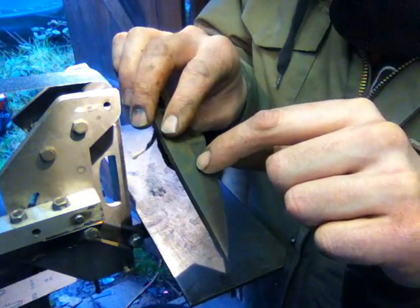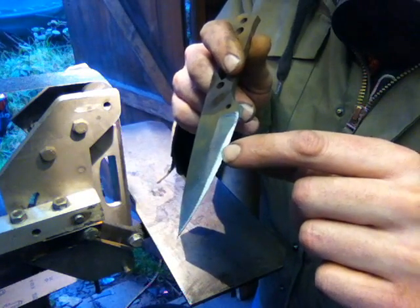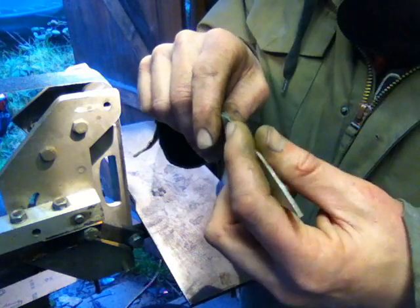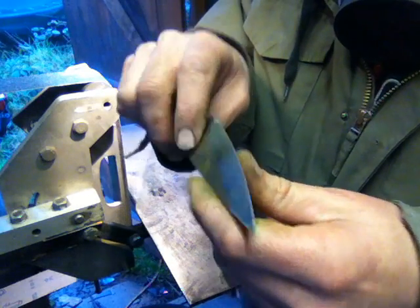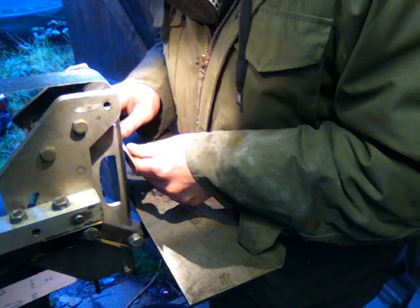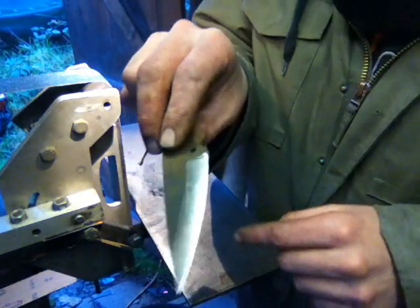I found that if I lead with the shoulder of the bevel, by the time you've rectified it, you can end up taking that a little bit higher than you want to. But if you lead ever so slightly with the edge, it tends to kick the blade back slightly, and of course you've got all this meat to play with before you even need to worry about messing up the edge. So even if you do go in a little bit too hard, it will just take a little tweak off that, and then you can rock it in and get your approach right. So that's what I'm going to be doing: going in, leading with the edge ever so slightly, softly, softly, then feeling the belt as I go in, and that's when I know it's flat, and then I can bring it back across to the plunge, back to the tip there. And we'll straighten out this smiley face, all right?